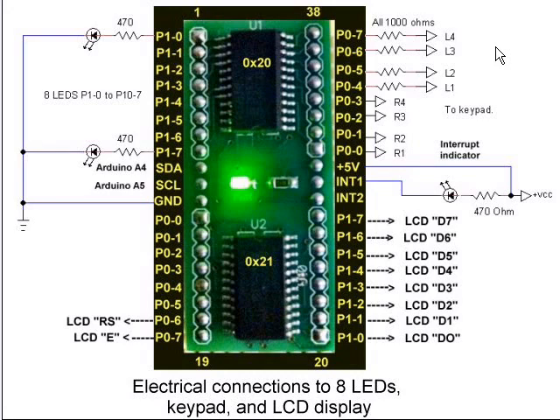The key scan codes will initially be stored and displayed on the LEDs. Then as we move along, it will actually store codes and messages on the LCD display. I'm using this single module to operate an LCD display, a 4x4 keypad, and 8 LEDs, with 6 lines still left over, plus the interrupt system connected to Arduino.